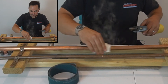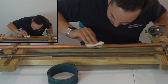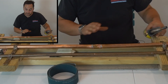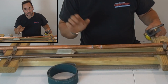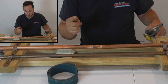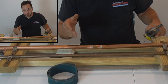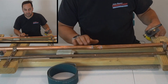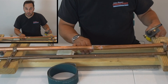Go ahead and wipe that. Take a quick look around and make sure you have no pinholes. The solder filled in nicely — that's going to be there for a long time. If you do it just that way, you're not going to have a leak. Remember: sand your fittings, put the flux on, make sure everything stays clean, and don't touch the fitting or the pipe prior to making the joint. When you follow these procedures it just makes the solder flow so much easier. I hope this helps you — continue to watch our videos, thank you.